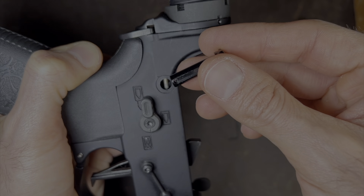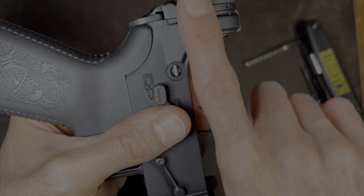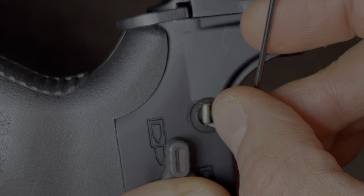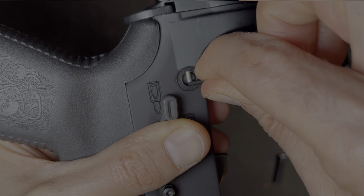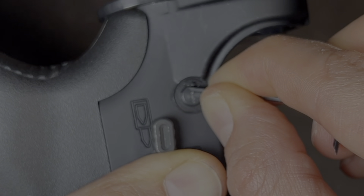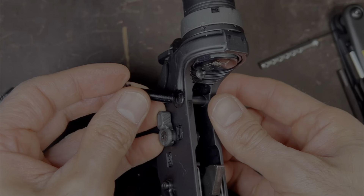Now what we need to do is put the new pin in, and how we do that is by using the old pin. I go in through this side with the old pin and push it against the detent, pushing the detent back this way. By keeping pressure on the pin towards the detent, it'll stop the detent from coming back down because it's spring loaded. I'm taking the angled part, getting underneath the detent, and pushing the detent back up. I'm applying pressure this way with my finger with the pin, and you notice that the detent is not coming back down. So now I have the detent captured with the old pin.